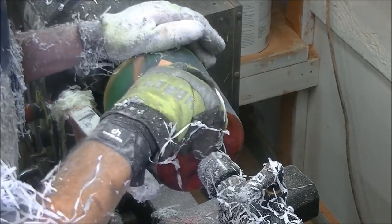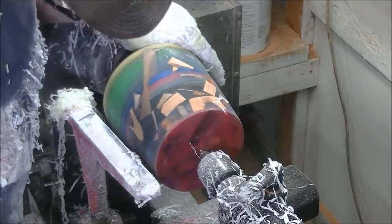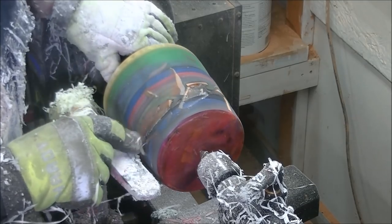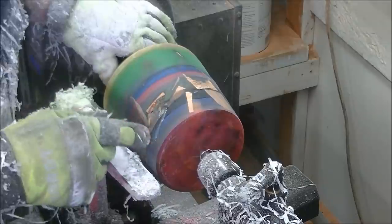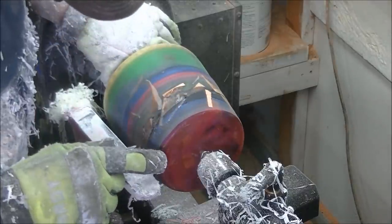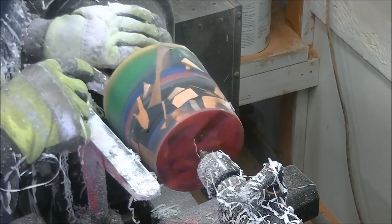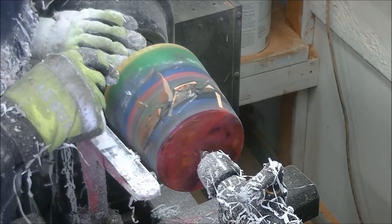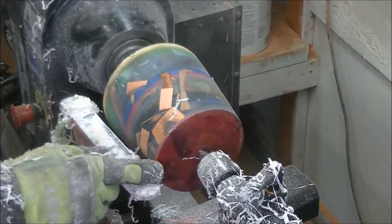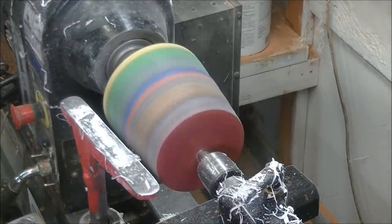Still got that place that was sort of sticky — that means I didn't have a good mix on that epoxy. So we've got to go down past it for sure. None of this appears bonded, so that would be a good place to put the indent for the pedestal. I'm going to start and try to get this down narrower right here and leave the outer part alone for the time being. I have some nice figure under there — I see a gumball right here. I've got to get down to those because you want them to show. It's about 2,900 RPM right here.